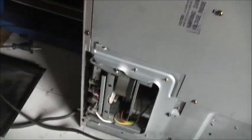There's the inputs and outputs on separate cords instead of sockets. So 50, 60 Hz, you can select the voltage, so it's a Japanese import, this one. It's a model CT200. I think that motor could be weak, because that belt is not very tight. That turns pretty easily, so yeah, that motor sounded pretty good on its own. It felt good to the touch, but it mustn't have enough torque to turn all this, so I think that motor could be worn out, unfortunately.